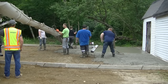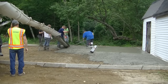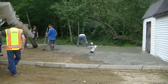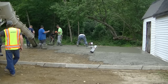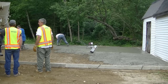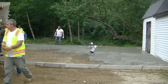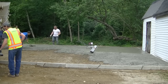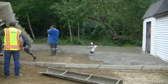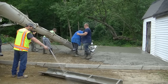Now we're just getting more concrete poured out. We had some leftover from a floor we poured this morning first — that first truck had a little leftover concrete on it, so we dumped that in to get rid of it. Now we're on to the truck that's going to finish this slab. This whole slab took about 13 yards of concrete — again, it was 30 by 24, averaged about 6 inches — and we're using regular 3000 PSI.